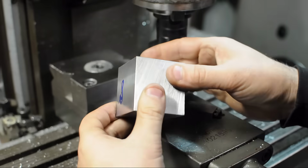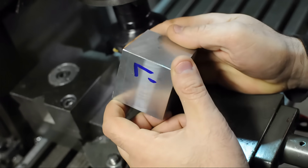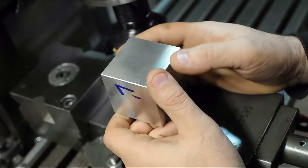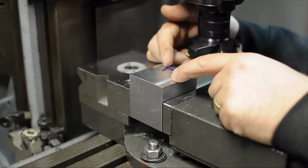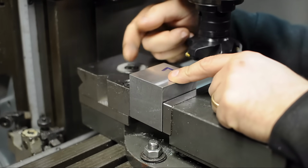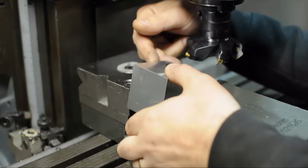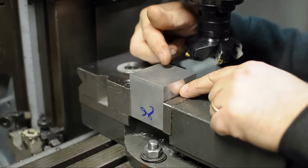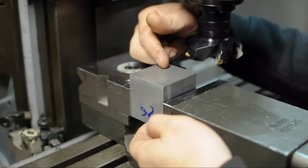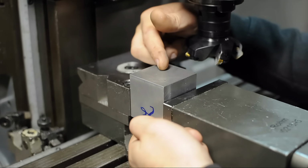All that's left now are the 2 tougher nuts to crack, Carmine and Frank. And as much as I hate to be the bearer of bad news, let me lay the problem on you. Every cut we've made so far has resulted in a face that was perpendicular to the last one, or perpendicular to the fixed jaw. In cutting these last 2 sides, really just one side, that 5th cut is the tricky one. Once this is done, the other one will sort of fall in place. Once you break Frank, the big ragu will fall in line.